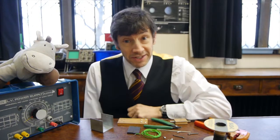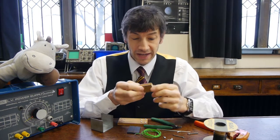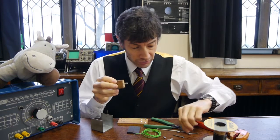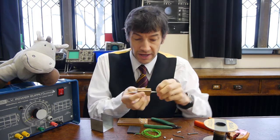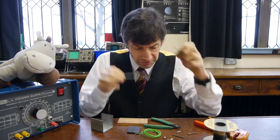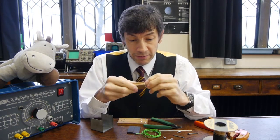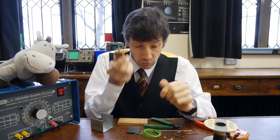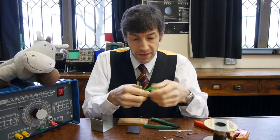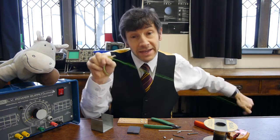The joy of the Westminster kit is that you can see all the bits of a DC motor broken up and put one together. I've got a little wooden rotor here with a metal bar through the middle which is hollow — that's going to hold the axle which will allow the rotor to spin. These used to get a bit bent sometimes and wouldn't spin very well. Because this holder is metal, you have to wrap a bit of sellotape around one end, and you'll see why in a minute. As you know, a rotor is a coil of wire or multiple coils that make an electromagnet.